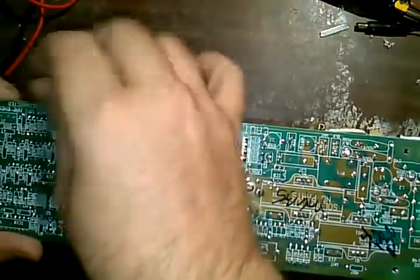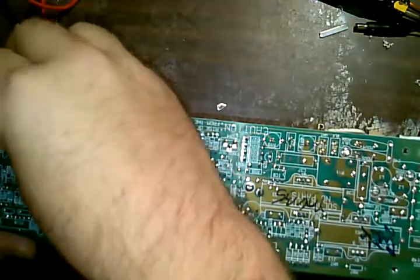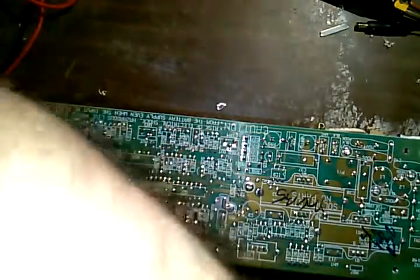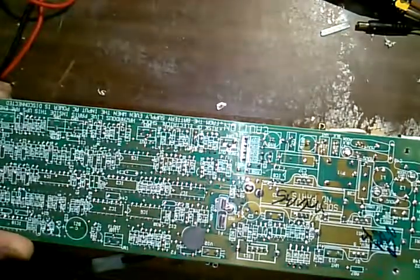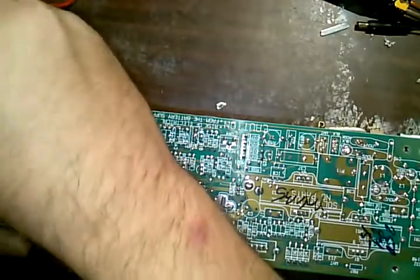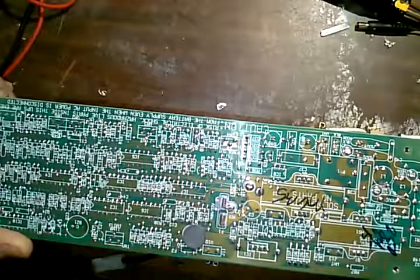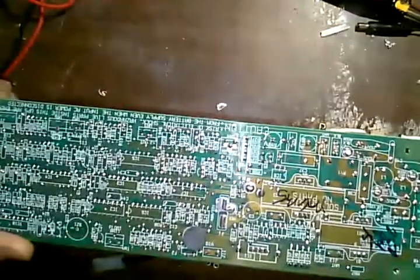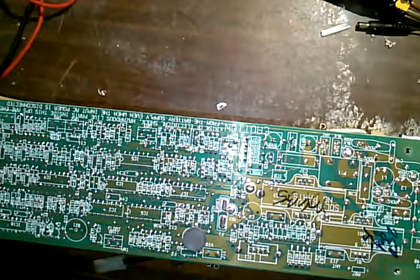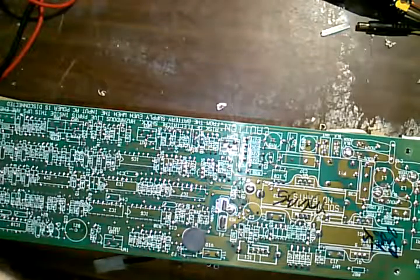Rewatering them, if you have a bad or shorted cell, it's going to try to re-energize that water. And it'll even show a capacity greater than what it already had. However, it'll never charge all the way. Once it starts getting close to its actual capacity voltage, it'll start getting really hot. The battery will. That's never a good sign.